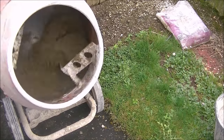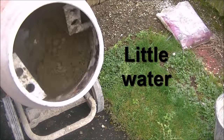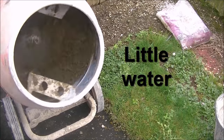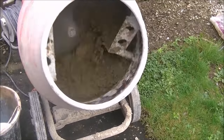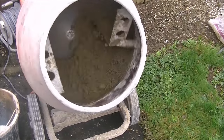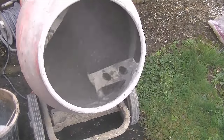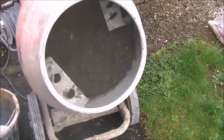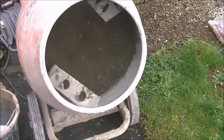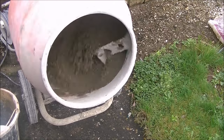Sand and cement floor screed semi-dry — if you are concerned about strength you can give it a mist of water. I'm adding very, very little amounts of water. You can see in the middle where it's starting to come together — that's the way you want your screed to be. So now that my sand is damp enough I can go ahead and add my cement. I have a full bucket of sand in there and a quarter bucket of cement just for this demo.